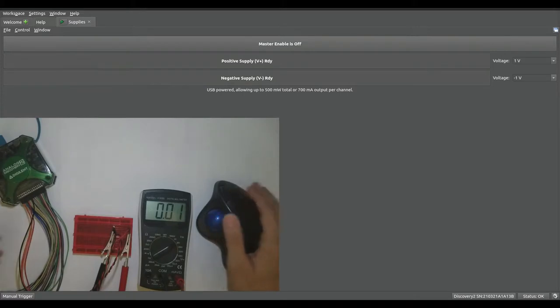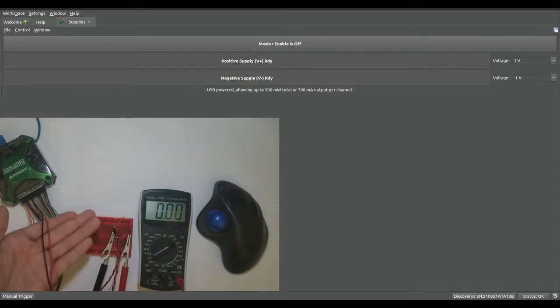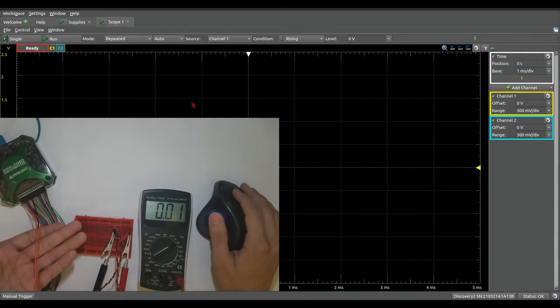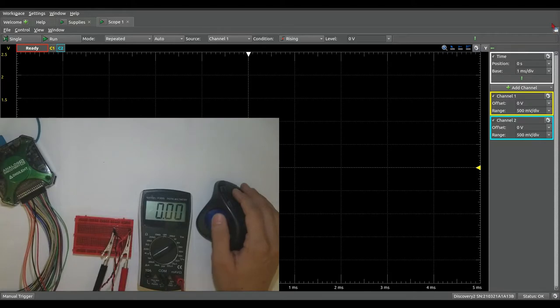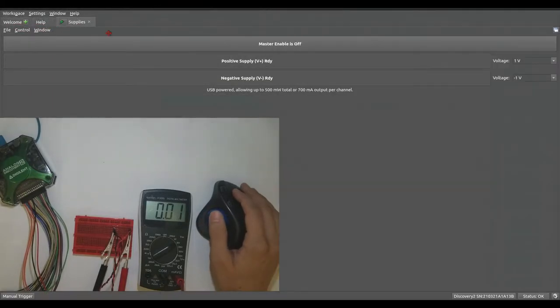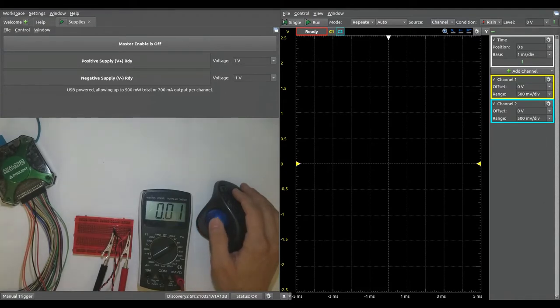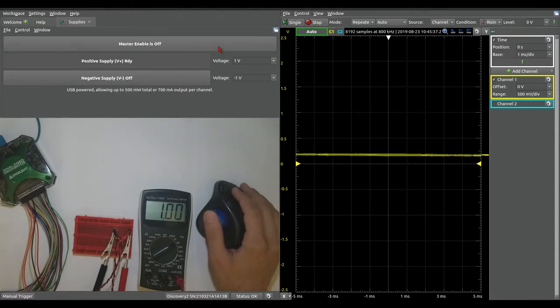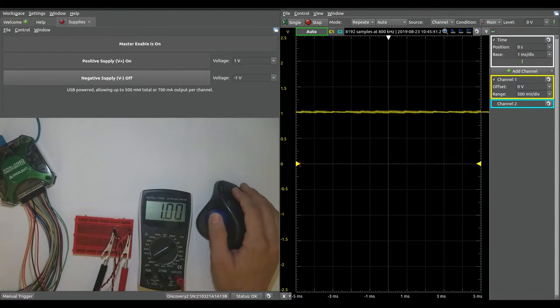Here's the view of the variable power supply, which is the red and black wire. And we have the scope, which is the orange wires. You can click this button to split up the menus into two windows, so you can view them side by side. Go ahead and turn the negative supply off, and then turn channel 2 on the oscilloscope off. Let's turn on the master enable, and then we can see one volt on our multimeter — the power supply is working. Then press run on the oscilloscope, and we can see one volt on the window. Let's turn this on and off a couple of times just to see it working on both the meter and the scope at the same time.